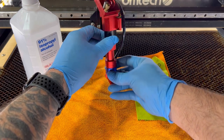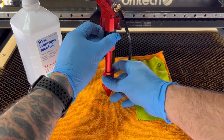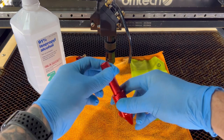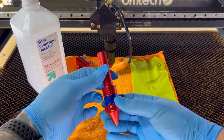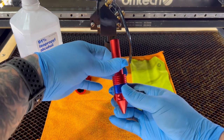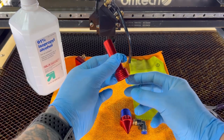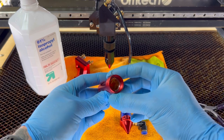You can loosen this collar by going counterclockwise, and what that does is it loosens this neck right here. So I can pull out this neck completely, and I'm gonna put the upper half down just because I don't need it right now. Now I have the lower portion of my laser nozzle. This is an additional collar, so this will just twist right off. And now if you look under here, you'll find the lens.